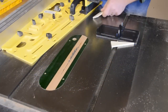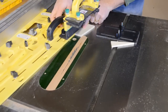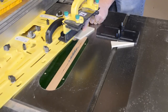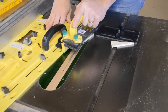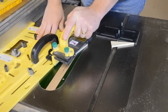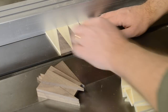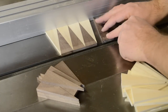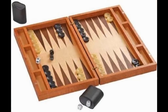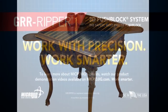The wedges being the off-cut also means that each time you work through your stack of parts, the rip fence needs to be reset to cut the next set of wedges. A stop mounted to the table saw on the outboard side of the blade ensures that each successive set of cuts will result in wedges of exactly the same size. These techniques will get you the four sets of six rows that make up a typical play area for a backgammon game. Where you use them, and how you embellish your board, is how you put your stamp on this project.